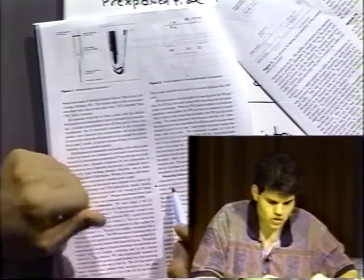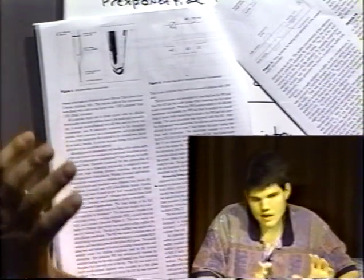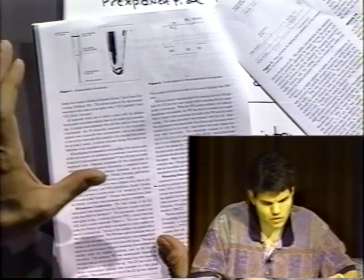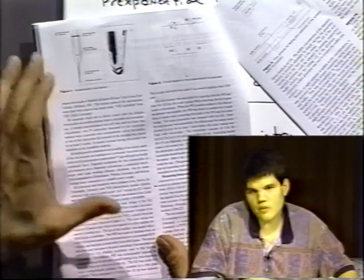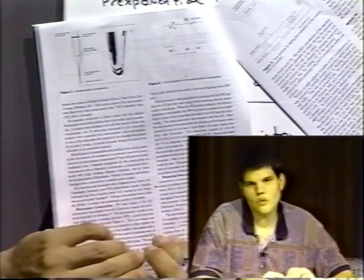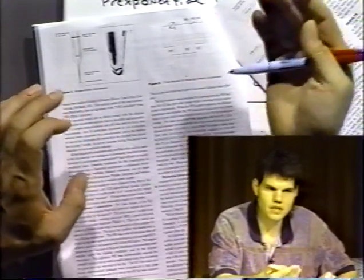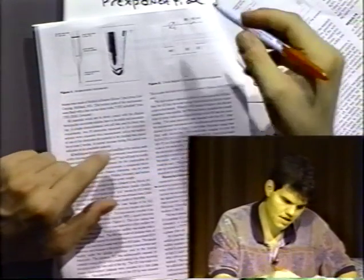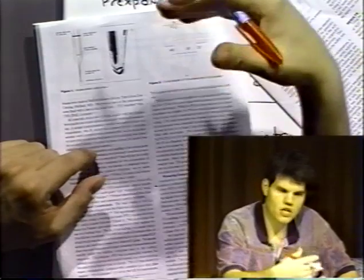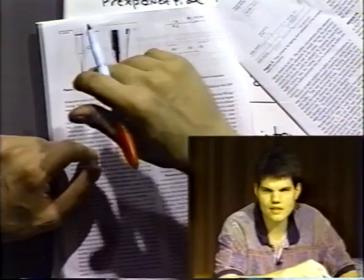They're saying they have an internal voltage source to polarize both the working electrode and the guard electrode. That means there is some sort of voltage source — maybe a battery — that can apply 150 millivolts or so. We use the word 'polarized' to suggest there is a potential versus the counter electrode. The polarization is required to get current to flow; you can think of it as an overpotential for that system.